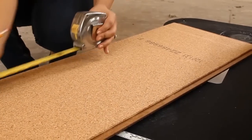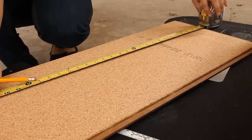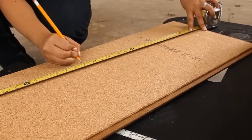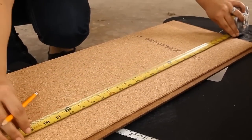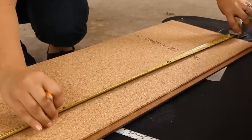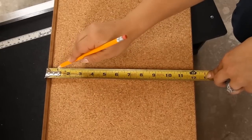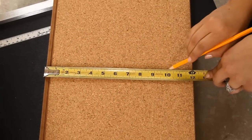When you come up to a wall or obstruction and need to cut a tile, take a measurement of the gap that needs to be cut. Mark the measurements on the underside of the tile. Depending on what type of cutter you're using, it may be appropriate to cut from the top of the tile instead of the bottom. The cutter as seen in this video is best used when cut from the surface.